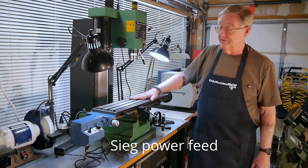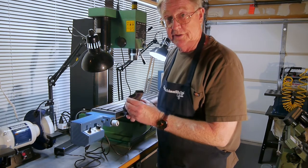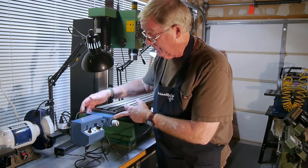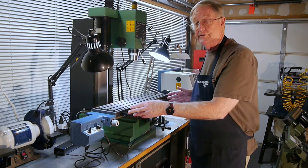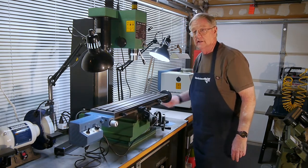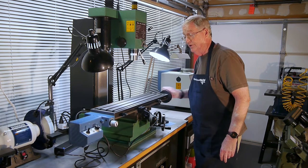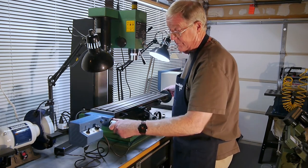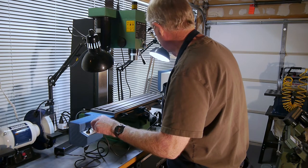Once you fit the table properly, the rest is pretty straightforward for mounting the power feed. I removed the plate I had put on the end for spacing, then took the screws and bolted the clutch back in the same place as the plate had been. I bolted on the power feed and then mounted the limit switches. Once disengaged, the traversal is exactly like it would be with a manual mill — no resistance or any other issues. If you do want to use the power feed, you simply engage the clutch. At that point, you can do a fast traversal, set the direction, set a speed, and off you go.